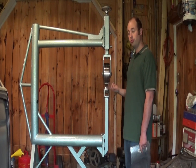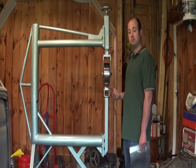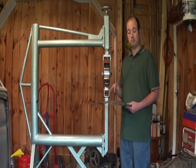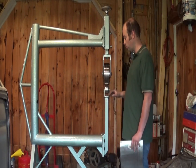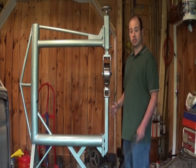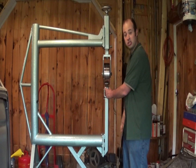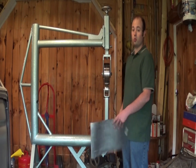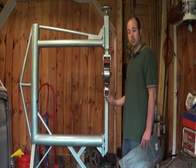The wheel on the bottom is usually referred to as the die, and they come in various shapes depending on what type of shape you're trying to put in the panel. As the panel becomes more and more curved, you have to go to a lower die that is more and more curved, because otherwise you can start hitting the edge of the die in the curve of the panel and you get what's known as wagon tracks, where you'll actually see tracks from the outer edges.